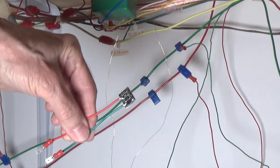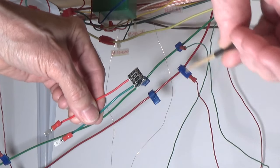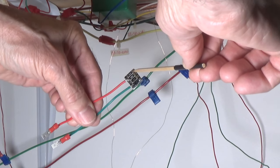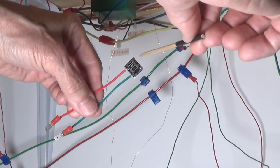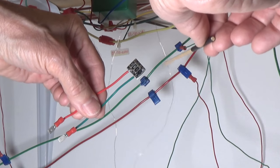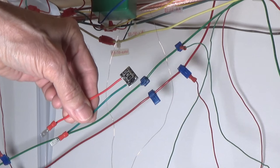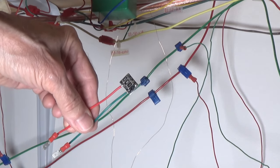I've prepared one of the little circuit boards that comes with these. You can see the red and green wires go to my red and green DC power bus — red is positive, green is negative. The positive goes to the one marked positive, and the negative goes to this one. On this side we have a row of four contacts — three attached to resistors of three different values — so you can get three different brightness levels by simply attaching the wire to the one you desire. Attach your negative wire here, then by hand touch the positive wire to each one of these in sequence and look at the brightness of the LED as you do that.